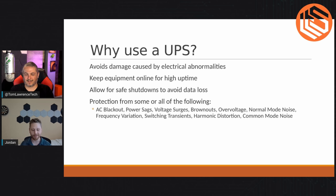Common mode noise between your neutral and ground can only be addressed by bonding neutral and ground on the output of an isolation transformer. In industrial environments, starting and stopping machines causes voltage sags — you can actually notice it in the lights flickering. Modern switching power supplies compensate for voltage, but if the voltage goes too low for too long, they get hot and can be damaged. Let the UPS handle it.